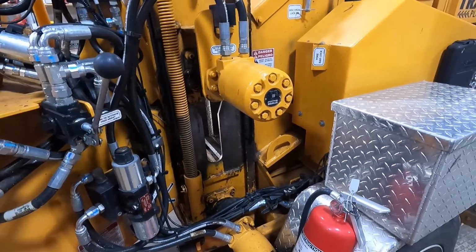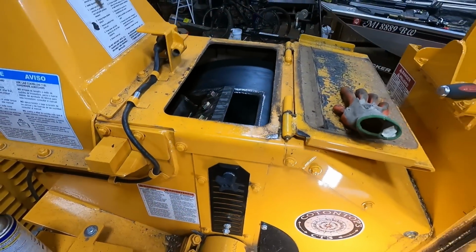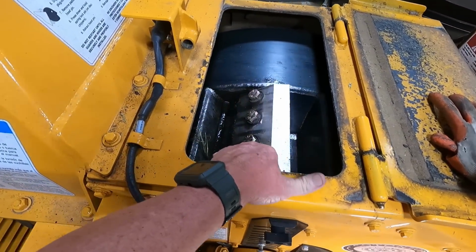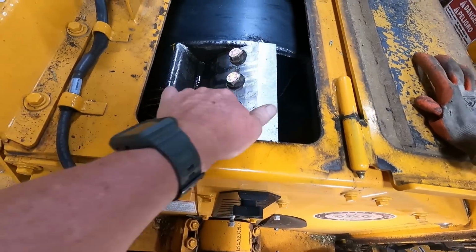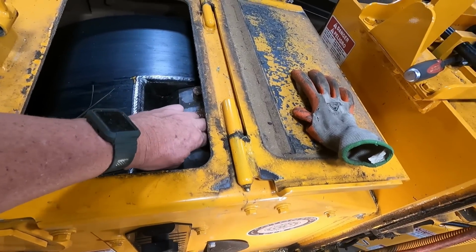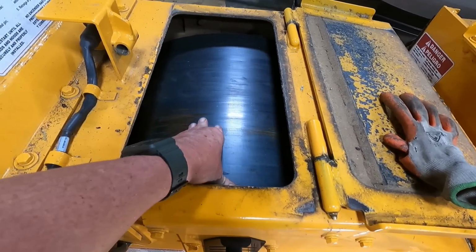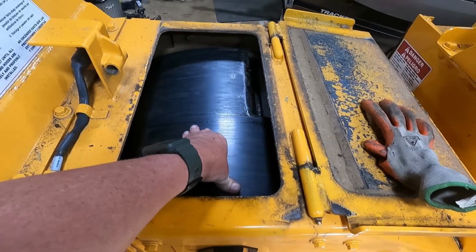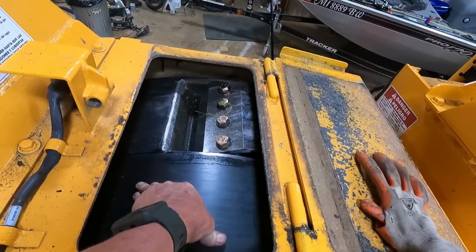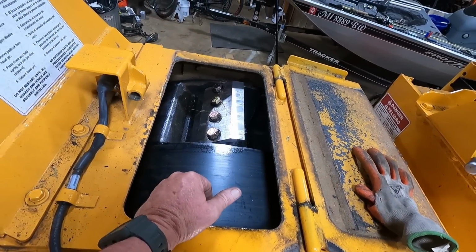But I'm sticking it back in there, same edge cutting. I did not film any of this, but I did just put a new set of knives all the way around it and bolts in it. They say to replace those bolts after every 4 times you pull them out. So I put a set of new bolts on them. I'm not going to take no chances on that. That's probably a good idea anyhow after you torque them to 280 foot-pounds. You can see them there.